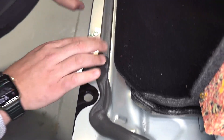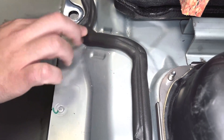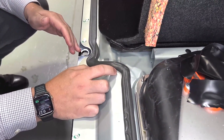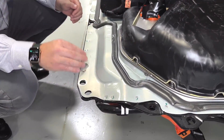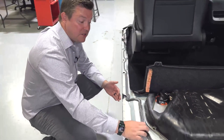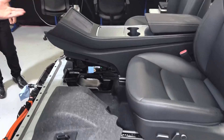You notice this is smashed real hard. The team at Monroe and Associates may have discovered a potential issue here — some room for improvement, though of course they could be wrong. It still has a lot of compliance to give. It may have done its job perfectly fine, but this is an area where I'd want to monitor if I was Tesla to make sure we're getting good compression. We did notice that the cover itself looks like it has some sort of clear coating, like a clear powder coating. We're not sure what that's for — most likely so that this sticks real well, because if it was just metal you may have to do a plasma treat. The fact that this console slides back and forth is really kind of wild.